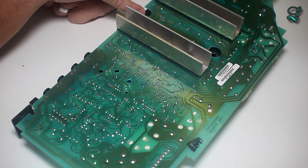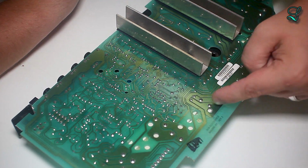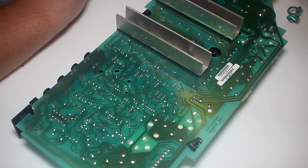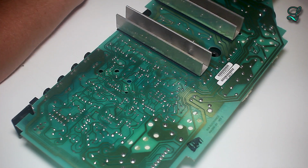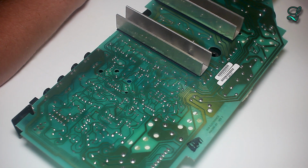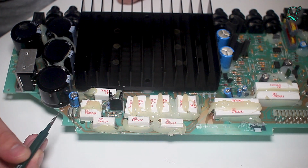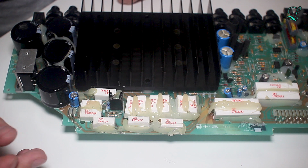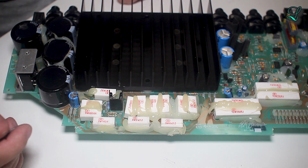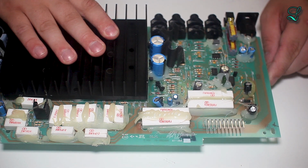That was well thought out. Again, these holes throughout the whole board, attention to detail is huge. These holes throughout the board near hot components encourage some airflow, and that's great. It's really nice to see. This transistor that has a heatsink on it, it's awfully close to this fan connector. I'm wondering if that actually is driving it. I don't know. This board has quite a bit of flex to it when the heatsink is attached.